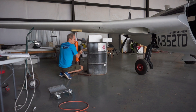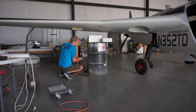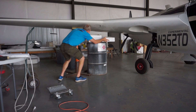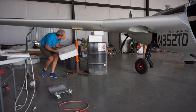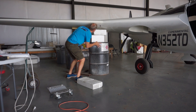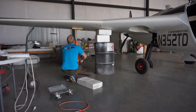I'll get on board and take those numbers. We know the gross weight of the aircraft with Justin on board and the fuel we're going to have - it's going to be about 3,500 and something pounds. It doesn't really matter that precisely at this point because Mark's calculations are ranges, so saying we have 3,500 is pretty much as good as saying 3,550. We'll look at the nose gear weight and subtract it from 3,550 to know exactly how much weight the wings are carrying.